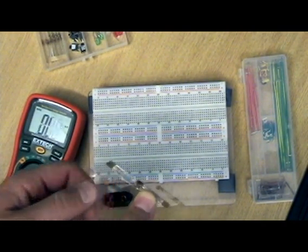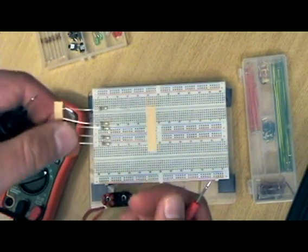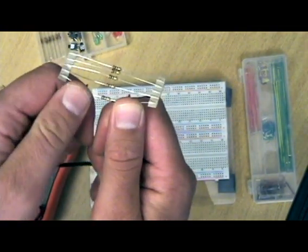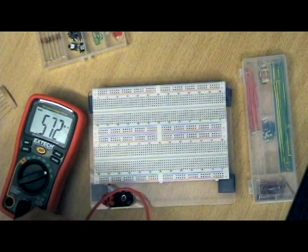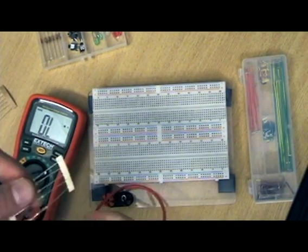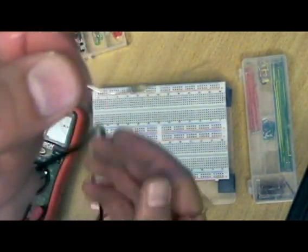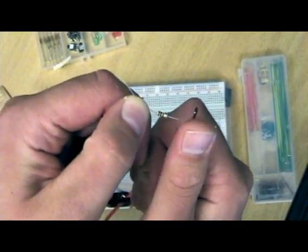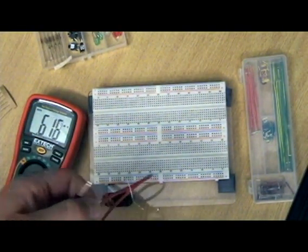But just to make sure, let's take a look at some of the other resistors. Here's another resistor set right here. I'm going to measure one of these resistors. I'm now holding on to either end of the resistor, and if you look at the multimeter, it says 0.59 MegaΩ. So that's not a 10kΩ resistor. And just to verify that nothing is happening with respect to this little piece of paper attached to the resistor, let's take the resistor all by itself. Attach to one end with my fingers and thumbs, and the multimeter says about 0.6 MegaΩ. So that's not the right resistor.